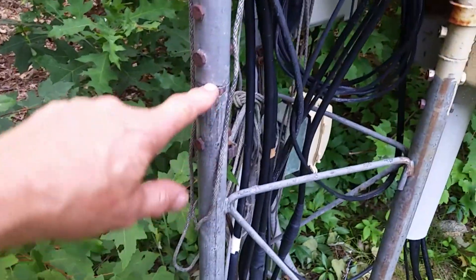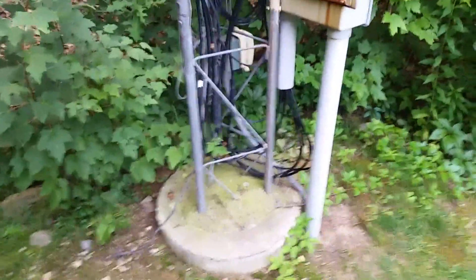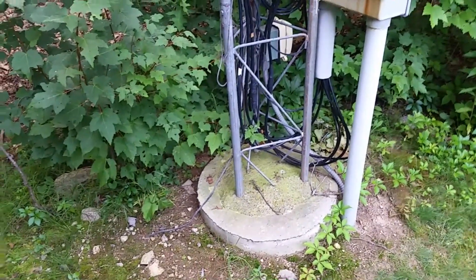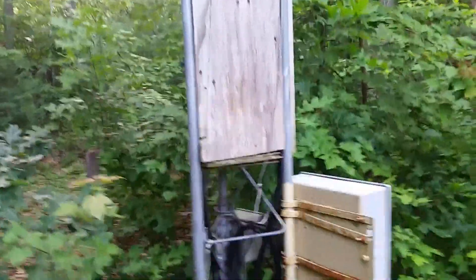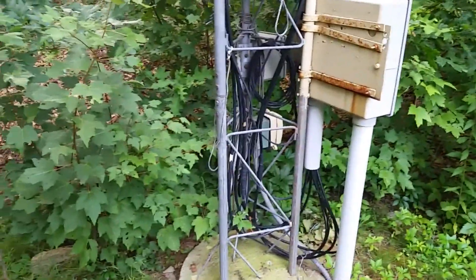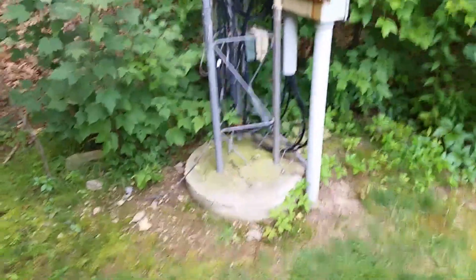There are several ways of doing this correctly. You could put a concrete form tube in the ground, put in the appropriate rebar and J-hooks, and mount a plate on top that is free to move a little bit and bolt it in. A second option is to use a base with a pin in the middle, and they make a special bottom section of tower that comes to a point and fits over that pin. I'm not going to tell you which is right or wrong — that's up to an engineer and local building codes.